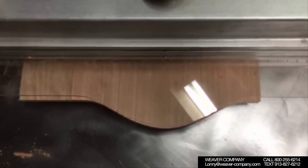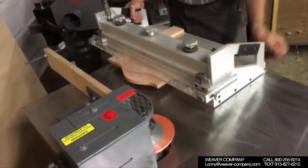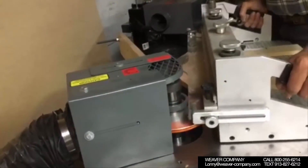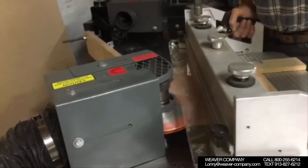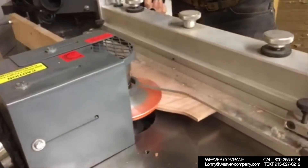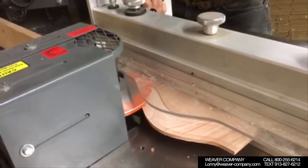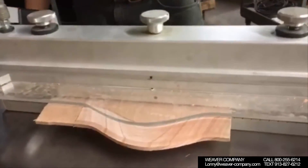The panel has been shaped out in the panel trimming unit. This is in the second shaper master that comes with the six shaper system — so we have two shaper masters with the six shapers, and one air tenon jig. Now we're going to raise the panel and run it to the top of the panel, getting it raised out in the shaper master. Now it's raised on the top, and we've got the crown work done for the cabinet door.